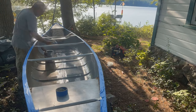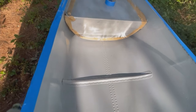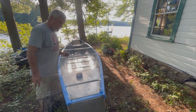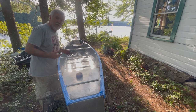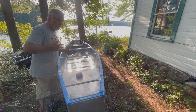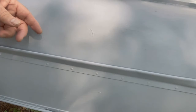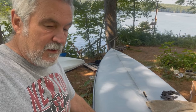Now I'm done with the primer coat on the inside of the boat — it took maybe an hour. This Parker duck boat primer went on really easy, nice and smooth. I used less than half a gallon, barely a quarter of a gallon. I'm going to flip the boat over since it's going to rain tomorrow, and I'll finish the job when the weather clears the day after tomorrow. In these little braces, some stuff got in there that I had to clean out — about 99% clean and ready for the final coat.